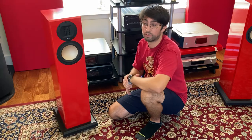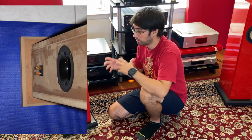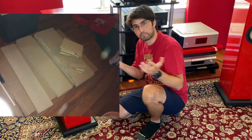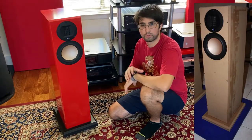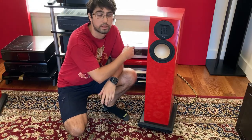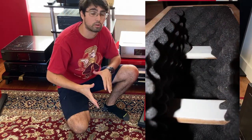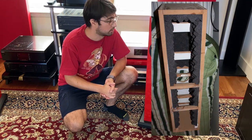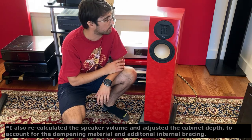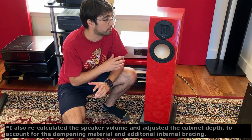A lot of glue, a lot of cursing everywhere. But when you're making the cabinet and putting it together you actually see everything that's happening and it's happening pretty quickly even if you're making mistakes. So you see all this flat pack of MDF that you've cut up become this beautiful piece. Another big part of this build was internal dampening inside the cabinet. I put a lot of dampening material. I lined all the walls with acoustic foam that I bought online. It's got really good internal dampening and it helps quite a bit to control all the bass and gives it a really good response.